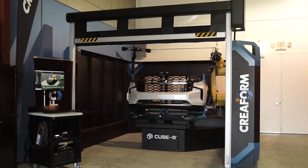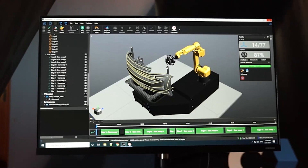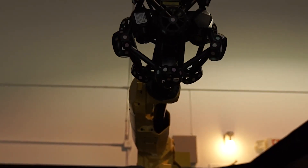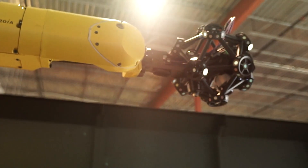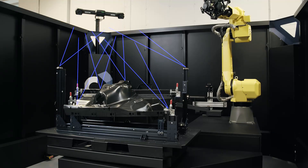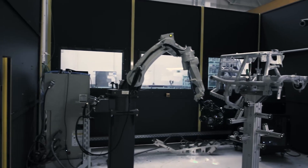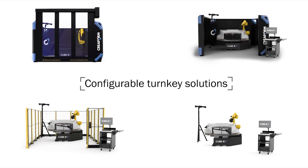Before we get started with a full speed scan, let's take a look at the setup inside the cell. This is a Chevy Tahoe front fascia mounted onto the rotary table using a simple lightweight extruded aluminum fixture. On the fixture, we've mounted a few of our 12mm reflective targets. The scanner itself, the MetraScan R, is mounted on the robot arm and also has targets on it. Together, the part and scanner are tracked by the C-Track using Creaform's dynamic referencing technology, which gives the Cube R immunity to shop floor vibrations introduced by nearby running machinery. The components of the Cube R — the C-Track, the MetraScan R, the robot, and the rotary table — can be separated into a core unit that's fully integratable for an inline quality control solution.